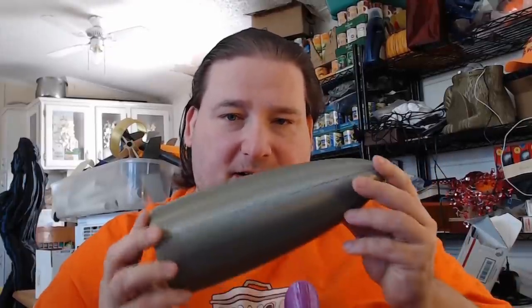So you want to make a complex shape like this, a nose cone, but you need structure on the inside. You need some kind of substance on the inside of the nose cone so that it's stronger. Because if you did this just as a single perimeter vase all the way up, it's not going to be very strong. It'll be light, but it won't be strong. And you can apply this to almost any shape.